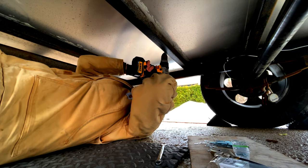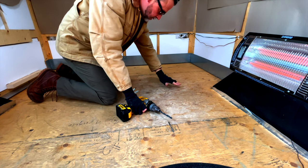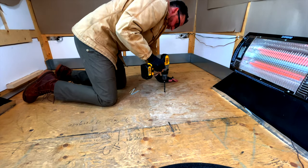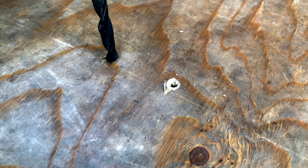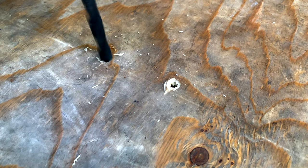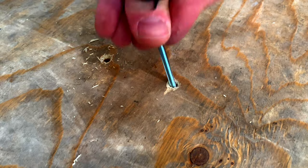To prevent the floating on the metal beams, I'm going to screw them down with two bolts on each side. These are 3/16ths, 4-inch screws that I'll be putting through the plywood. I'm just using a bigger bit to chamfer the opening so that the machine screw fits in there flush.